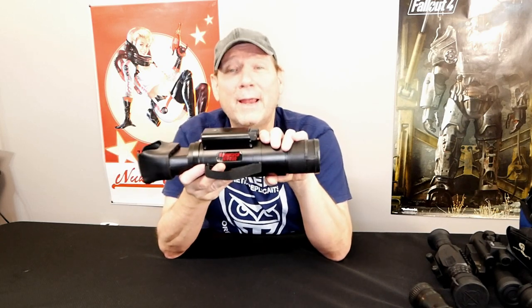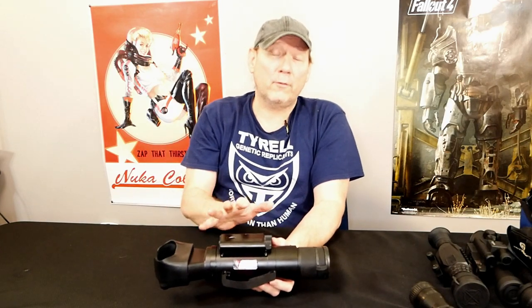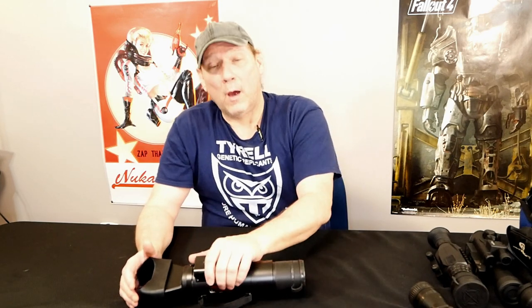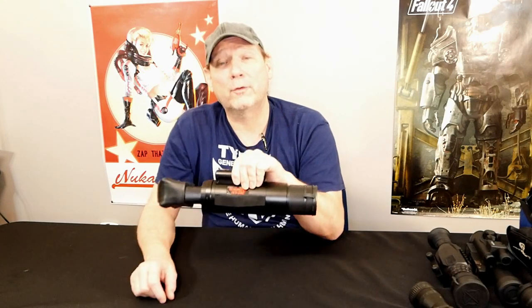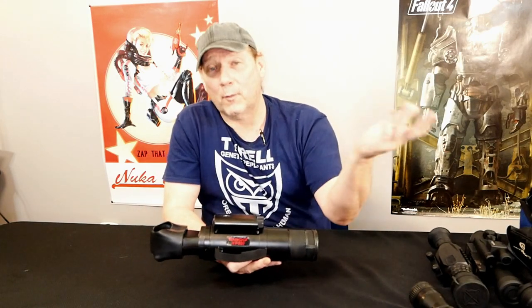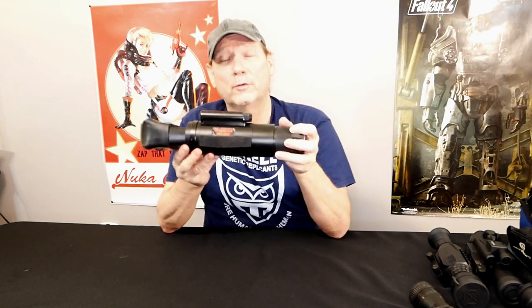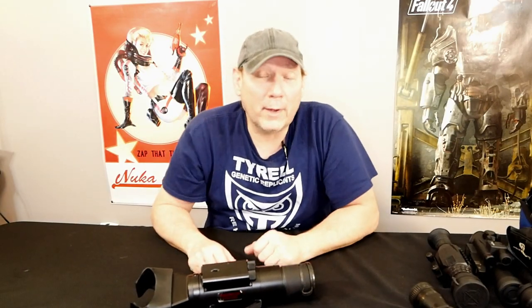This was probably built in the mid-80s. We'll go ahead and take it apart. I was successful in getting the tube out with no problems, disassembling the tube with no problems, and there are some caveats to doing all that that I've discovered. We'll go over all that, we'll tweak the pots, we'll do a cause and effect. The end result is that this thing went from being about 20% below in performance compared to my other two devices to where now it's actually operating in between them. That's a pretty substantial gain for just a little bit of time and fiddling. Let's go inside, look, and I'll show you what I did.